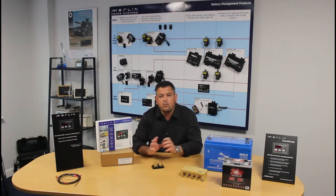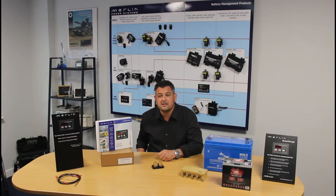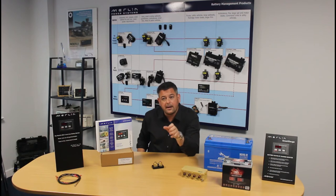Smart Gauge works in a very different way to this. The real secret of Smart Gauge lives here at Merlin HQ, and unfortunately I can't show you it. However, what it is is an extremely complex and highly accurate system that generates a computer model of any given battery. Smart Gauge is simply a measurement device that tests what it sees with your batteries against the highly complex computer model that is built in within the unit. It never runs out of synchronisation, and it will self-learn over a period of time — and over time the Smart Gauge will get more and more accurate.